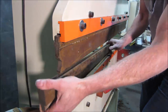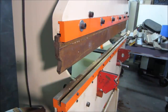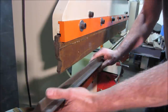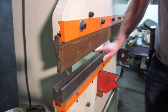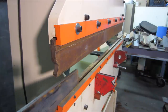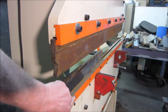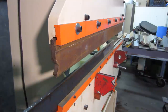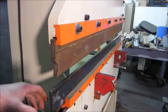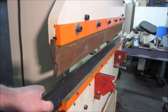The top die is going to be the same dimension, so we want to try to mimic or copy something along that line. The piece of metal that goes in the bottom isn't too sloppy side-to-side — it has a little play but there are set screws you can lock it in with to take up that play. It looks fairly straight; I was worried about that too.